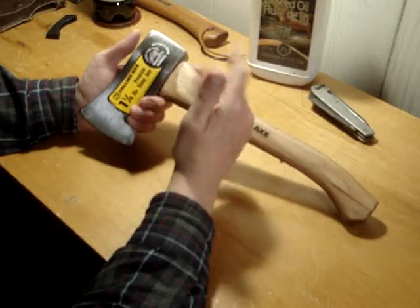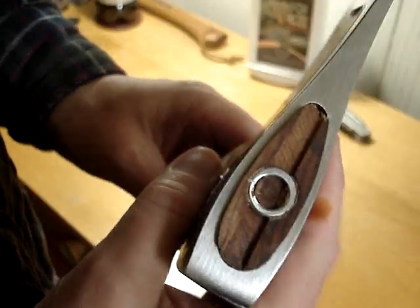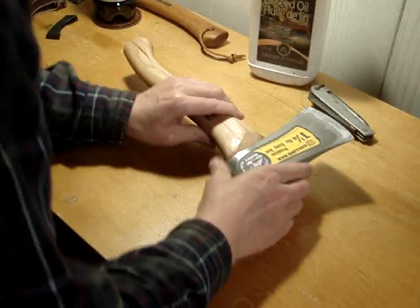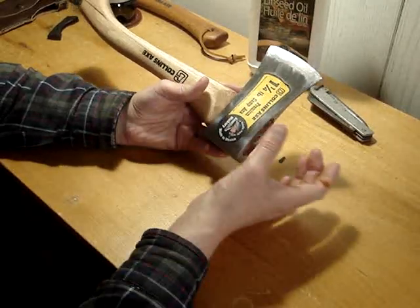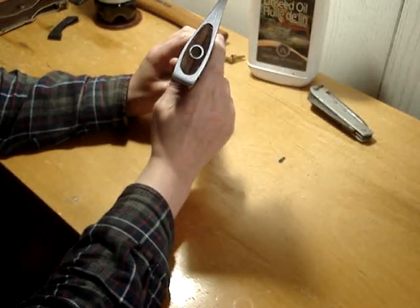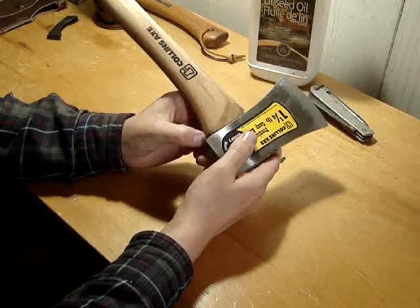After about an hour of use or less, I did get an issue — the head came a little bit loose. You can see here — that was flush. You can see how much I drove the handle in. I just drove the wedges in more. Technically the proper way to do it is to take the wedges out, take the head off, reshape the handle and get it on, and re-put new wedges. But I just filed and cut around here a little bit.